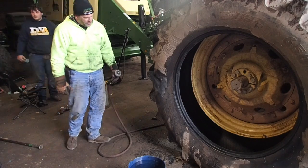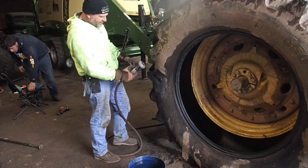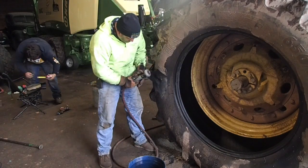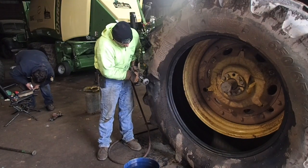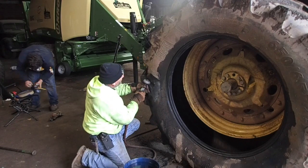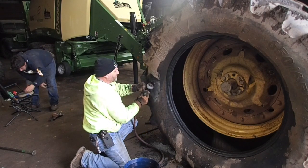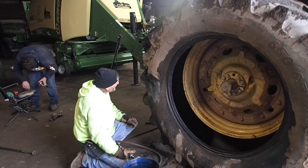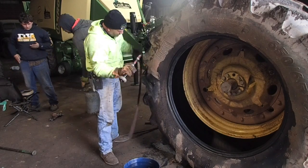And that piece of metal that I was just handling there, that is what Timothy is working on, a project with the big blast heater, that 600,000 BTU heater. The diffuser in the front of it had broken out, so it was gone when we got the thing. I called the machine the asphyxiator, because you work around it and within 5 minutes you're getting lightheaded and stupid because of all the fumes, and you don't smell it, but you knew there was some carbon monoxide, that's what I'm trying to say.